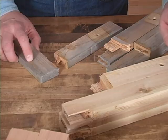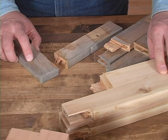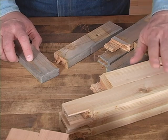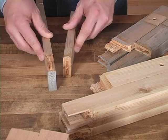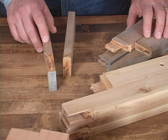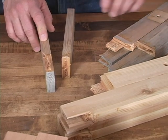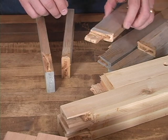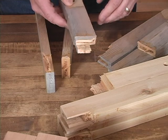The type 3 adhesives started out fairly strong and lost very little of their original strength, as we tested with our indoor samples. Any adhesive that lets you rip off the tenons on two samples is more than strong enough to hold your projects together. Even the sample that didn't rip off a tenon had large amounts of wood transfer.